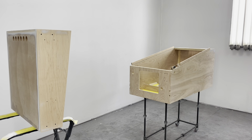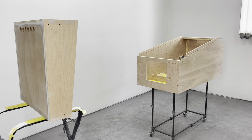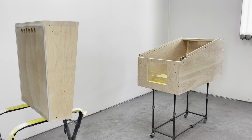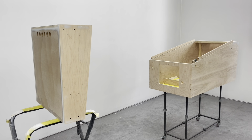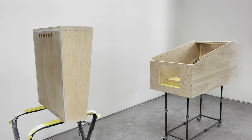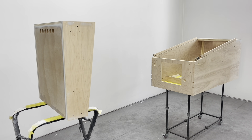I'm going to start out with sealer. The primer and sealer that I use are the same. They just mix in different ratios or different additives. So I'm going to mix it as a sealer because I feel like this is a really smooth cabinet. It's not very grainy. I've got all the work perfected. I should be able to seal it, then base it, and then clear it.